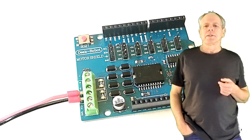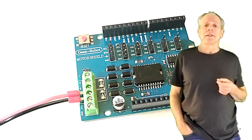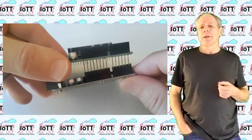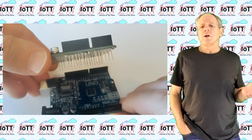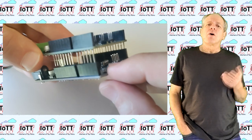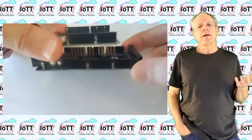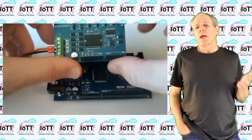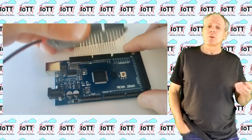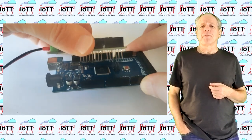Next is the motor shield. There is nothing that can easily be tested up front, so we just install it. First, we orient the shield so that the pinout matches the pins of the Arduino. On the Arduino Uno, this is a no-brainer as there is only one way to do it. On the Mega, that is the case as well, but it is slightly more complicated as the Mega has more pins than needed. To line it up, make sure that the power connectors of both boards are oriented to the left. Then place the motor shield in the most left position possible.